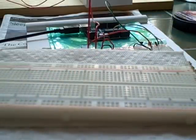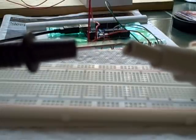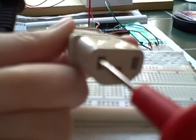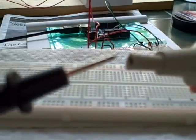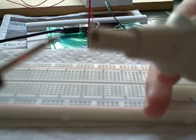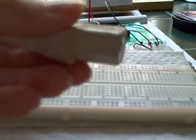We're still in the continuity setting. I'm going to plug this into the ground socket, or at least what I hope is the ground socket. And with my other probe, I'm going to touch the green. And I'm getting a sound, so that means that is our green. I'm going to touch the black and the white, and we're not really getting a sound there because we're not connected. Let's go test the one on the left — let's try black first. Yep, that's the black one. So if we go and put this into the right one, this should be the white. Yeah, great. So that's how to test continuity. Very cool. Thanks for watching.